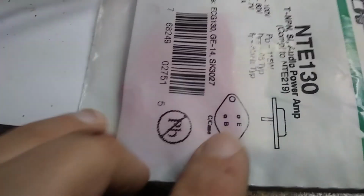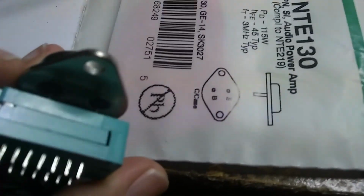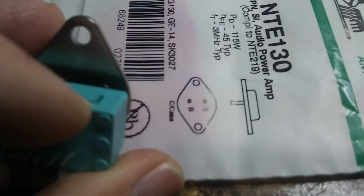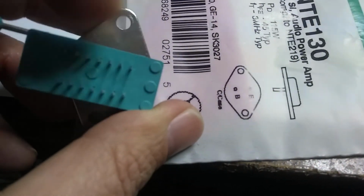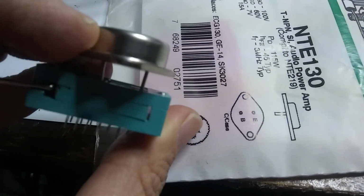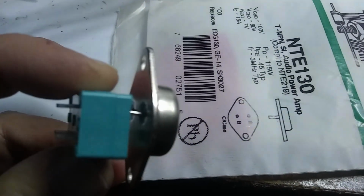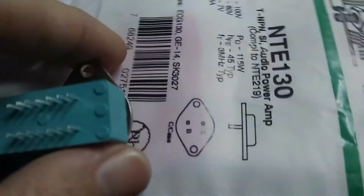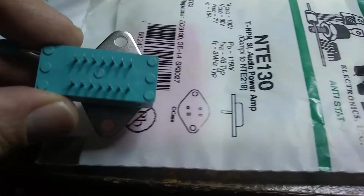Okay, so the base is going to be corresponding to this pin over here, and the collector, or emitter, I guess, the emitter is going to be this far right hand pin. Okay. See, it's above the center on these pins. So I got this in the same orientation. And so we want to tie these collectors together and to ground.